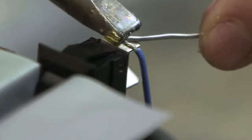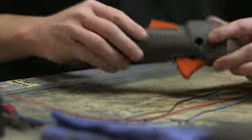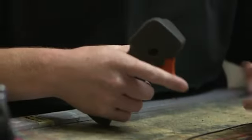I'm soldering the wires onto the kill switch and throttle. The throttle was a big development — I completely designed it from scratch, because a lot of them are using a bicycle brake throttle, a big lever out on the front. People would trip and fall down and land on the throttle, ending up with the motor at full throttle on their back.